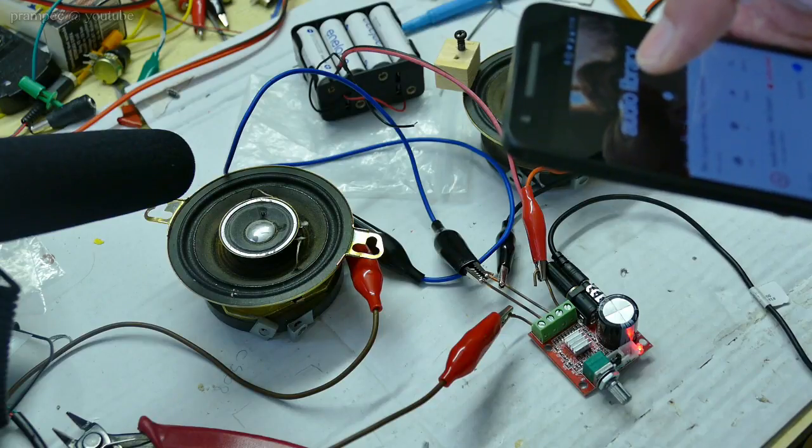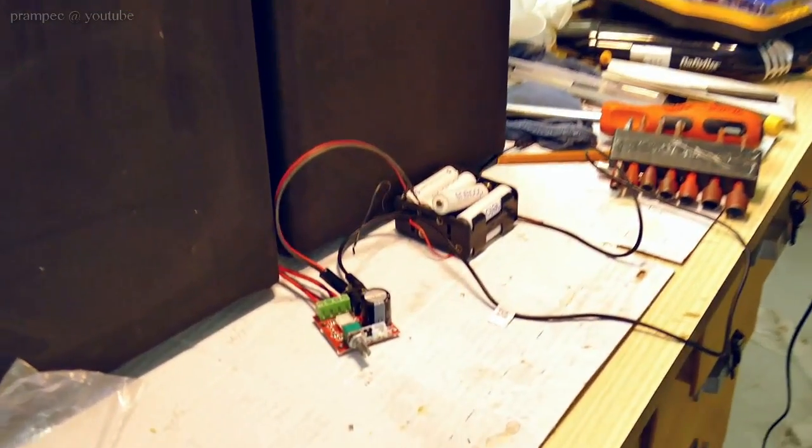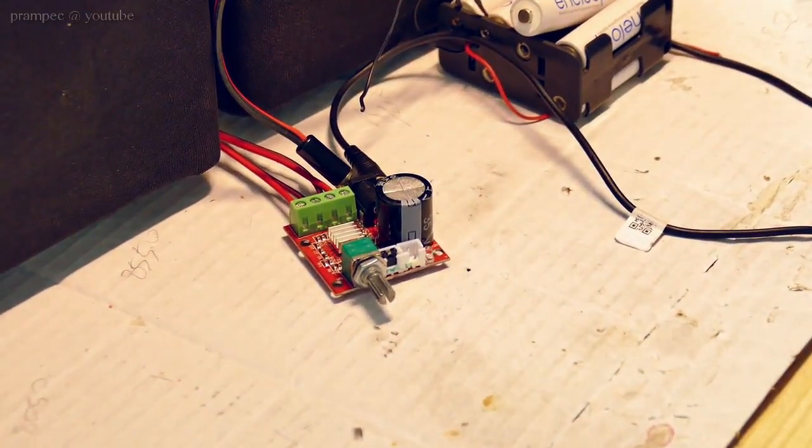About the sound quality — I'm afraid we cannot talk about sound quality with this much noise floor. Hard to summarize this, but we could see that the noise is not dependent on the input source. I also tried it with other input sources, and as the volume didn't affect the noise, it's not from the input source for sure. It's not even the power input as we were using batteries, and it's not the speakers — I have tried it with another speaker set with the same result.